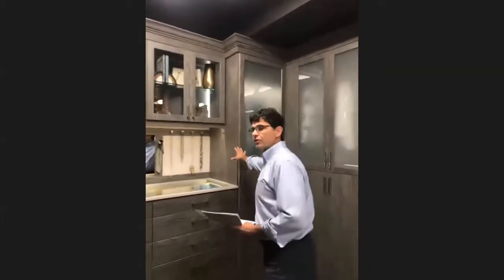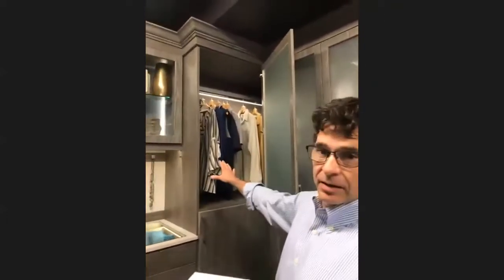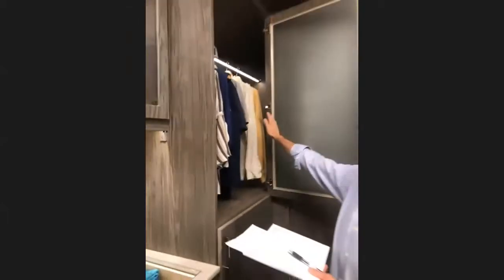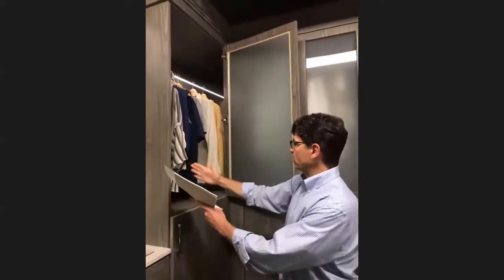Here's 24-inch deep material so you can hang inside of it. This is a dead corner, meaning that 24 inches of it is dead and blocked by this cabinet. When we do a block cabinet, we like to do a nice four-foot wide space, because if this cabinet were only 24 wide it would be a hundred percent blocked — it'd be a dead corner.